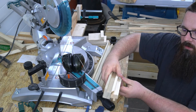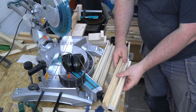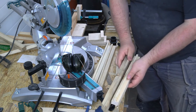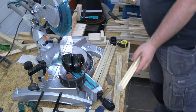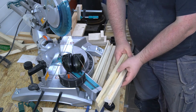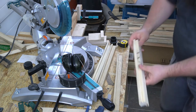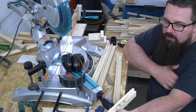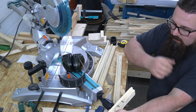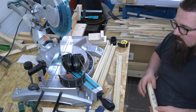You can see it is this one, and it is this one. The top has two different types of cuts. So this side and this side is the same. Having this template reduces the amount of measurements, and it's really accurate. It's very easy to set up a table also, and make these pieces repeatable over and over again.